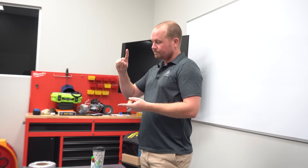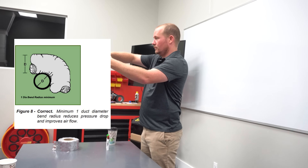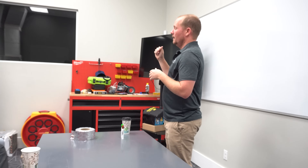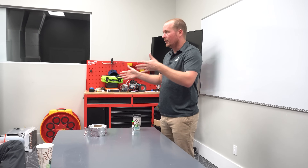When installing a duct system — regardless of material — we want it to be as straight as possible to reduce turbulence. When we make bends, we want nice gentle bends, or at minimum, minimal impingement on the bend. If you imagine a piece of flex turned on a 90, that internal corner is very rough as those ribs come together, creating a lot of turbulence. Even with duct board or metal, you wouldn't want a bunch of turns and curves. It's just common sense.